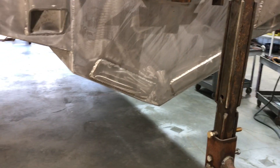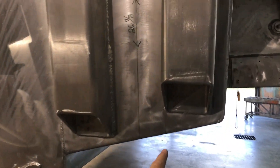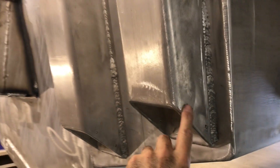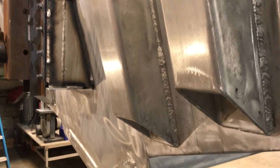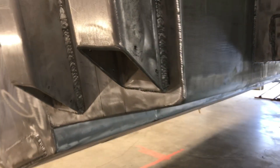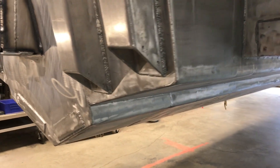Those two down there are the sacrificial areas to weld on the zinc corrosion control. I made little pads to go into the bottoms of these — you can see there are a couple of holes on each side. Those are quarter-20s; there'll be two bolts on each side so I can bolt those on and keep water from gurgling up in them.